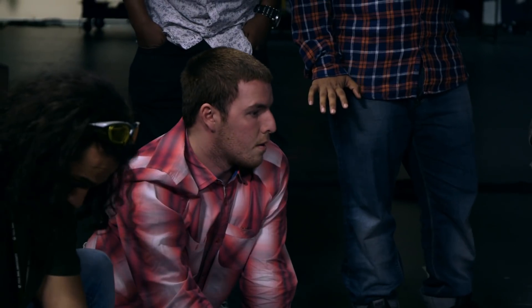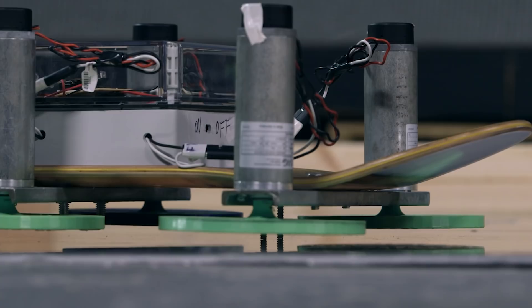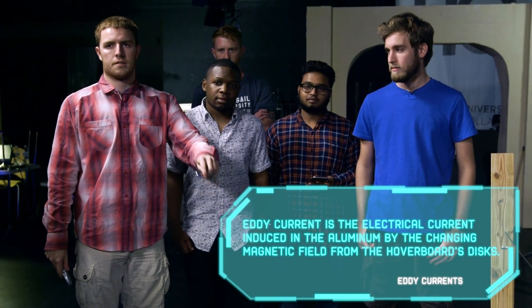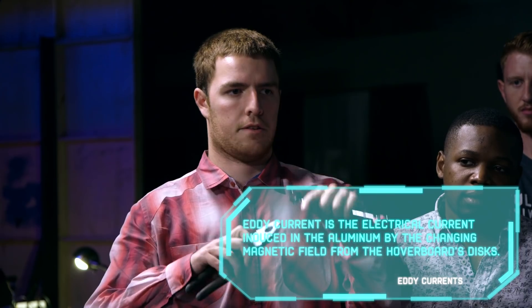Let's get closer. Move it a little bit lower. We're going to put it — go closer. So we're half an inch off the surface of the aluminum now. We could drop that a little bit more to hopefully get more repelling force, but we will lose RPMs as we go down. Because the closer they get, the more powerful the eddy currents become. So we have to find that balance right now.